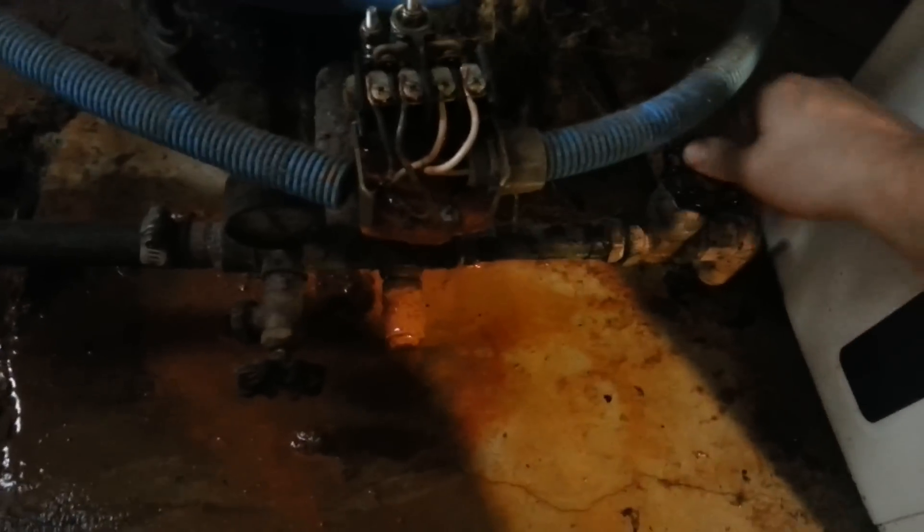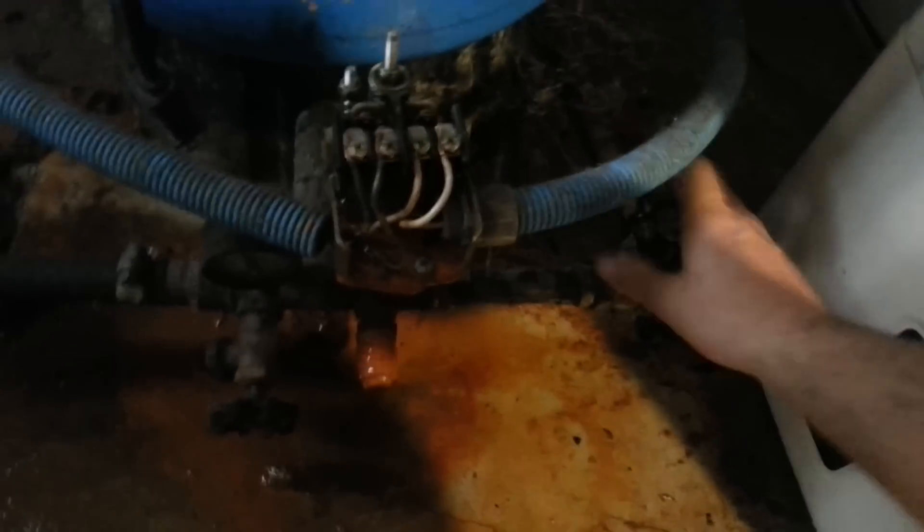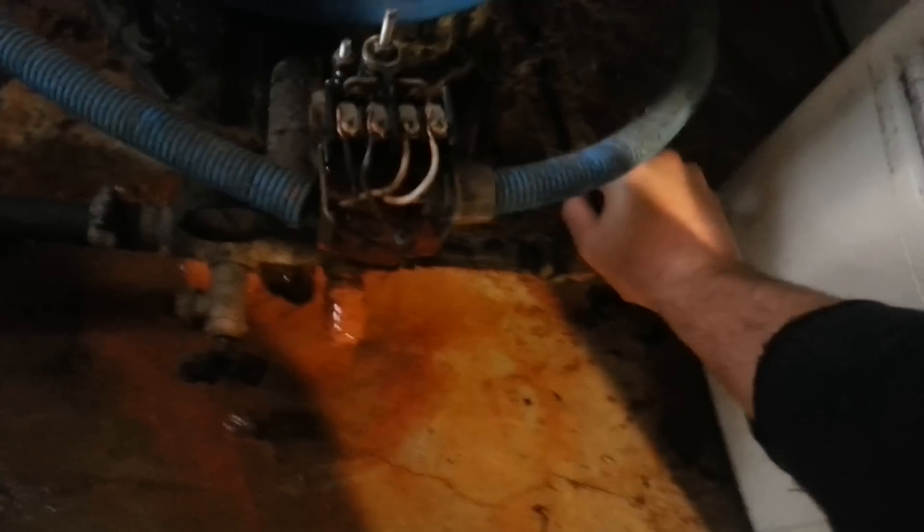You don't want any more water coming into the house. You're also going to want to make sure your dishwasher is not running, obviously, or that no one needs water for about the next 30 minutes or so. So that's shut off. Now we're going to want to shut off the well pump — or the water pump.